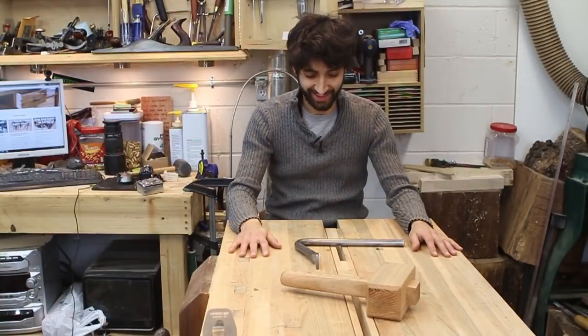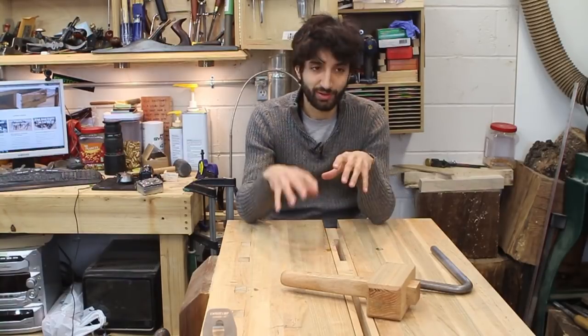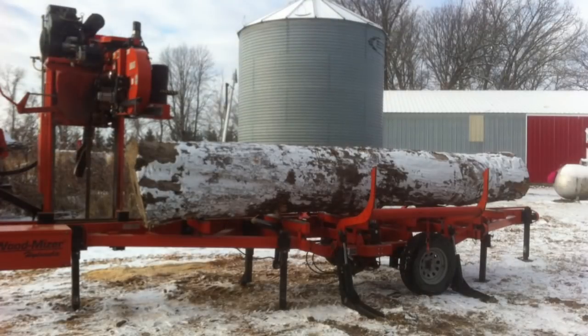Now let's talk about how I built this thing — quite the process. The overall project took me about 60 to 80 hours. It's definitely a big project and a lot of work, but I think it's absolutely worth it because this is such an amazing bench. Like a lot of my projects, I was involved in milling the lumber myself. The tree is a silver maple — soft maple category — and that log was 17 feet long and about two and a half feet in diameter. The boards I got were two inches thick, 18 to 20 inches wide, and 17 feet long — just giant boards. I ended up cutting them in half because I couldn't dry a 17-foot board, then dried them myself in my basement.